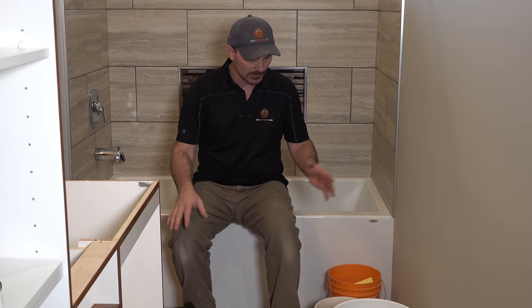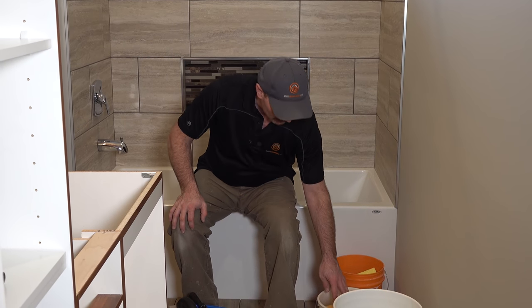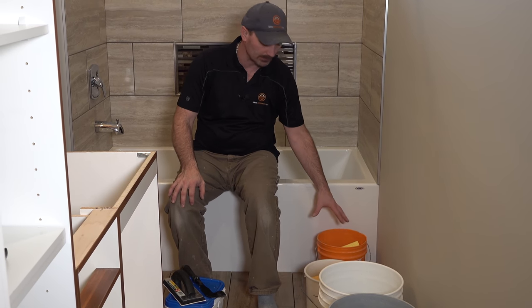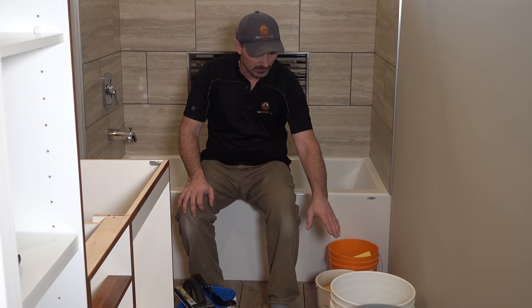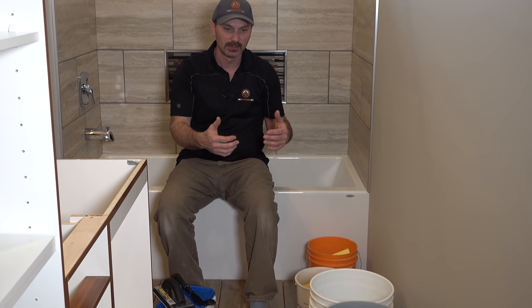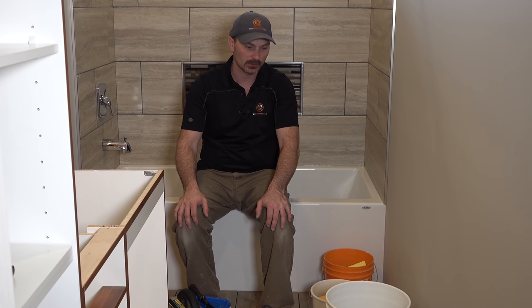Some of the things you're going to need — what I like to do is have a couple of small pails, each with their own sponge when I'm grouting. I've got one pail for the major cleanup where you've got the most excess grout to clean up, and then another one I keep cleaner for the final wipe so I'm not contaminating everything. I've got another pail of just clean fresh water to replenish these ones, and an old scungy pail to dump the dirty stuff into. It just speeds up the process — I can really keep myself moving and do this room without having to run outside to dump water or go to the sink to refill.